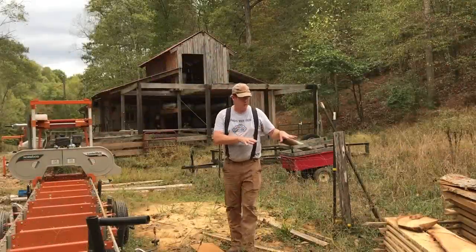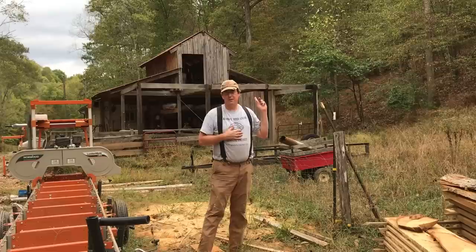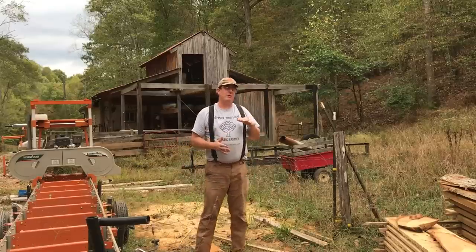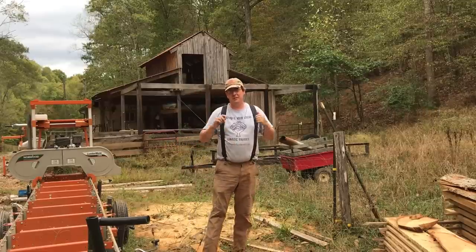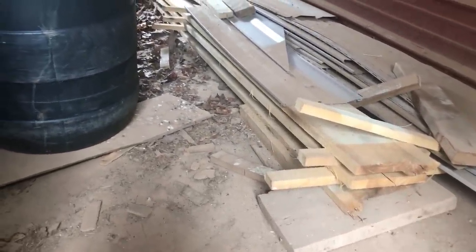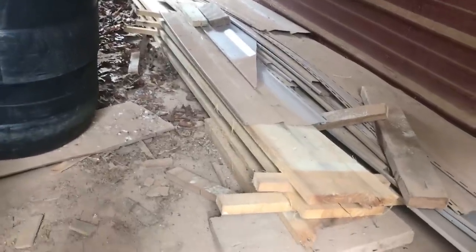The best option here at Red Tool House is to rick the wood up in a covered area, out of the elements. Last December — it's now October 2019 as I'm shooting this — Kelly and I milled a small stock of poplar and put it up in the barn loft. We're going to test that now, pull it down, and see what our moisture content is to determine if it's good enough for some interior projects. Here's the poplar ricked up with vinyl siding on top, tucked away in the dry of the loft. You can see it's even changed color from UV exposure, and it feels much lighter than when I put it in.